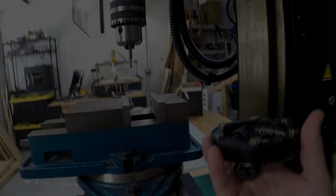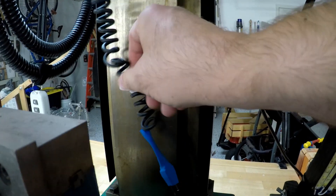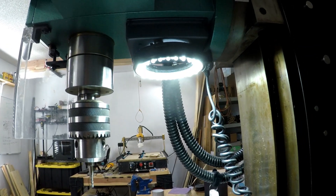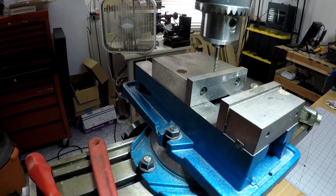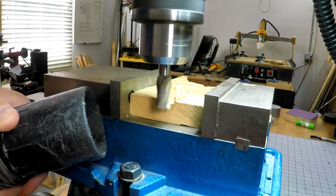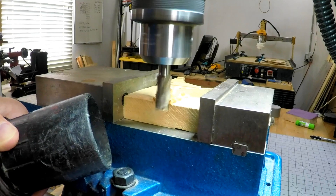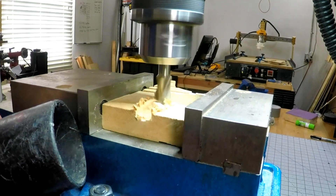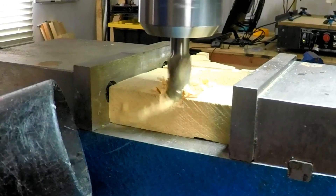After this video was pretty much done, I had the idea that I could just put the light to the side and have it shine from the side — not exactly what I had in mind to begin with, but the results are actually pretty good. Turn it on and you can see it looks pretty bright. Even when you push it down you can see a shadow on the other side, but if you're filming from the back side it shouldn't be too much of a detriment. Here I'm milling some MDF with a half-inch mill — looks pretty good. It's sucking some of those chips out with a shop vac. And here's a close-up of it in slow motion. Maybe it wasn't such a failure after all.